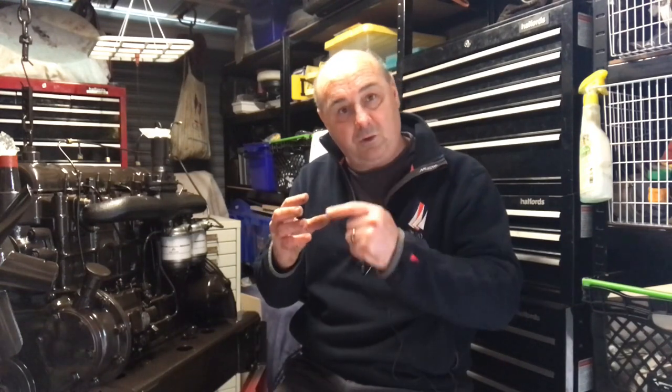Something that I didn't mention to you. Remember when we pulled the bevel gears out of the diff? Well, I looked in the parts book that night. In the core of the bevel gears is supposed to be a bush, and there isn't. There isn't a bush in the gears, but they fit that shaft beautifully. That shaft fits in the casting beautifully. So again, it leads me to believe that somewhere along the way, someone's been in there and replaced those bevel gears. We'll see.